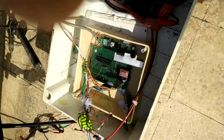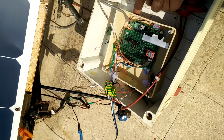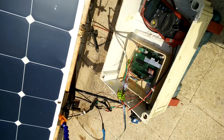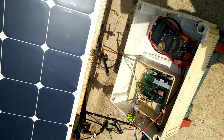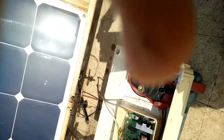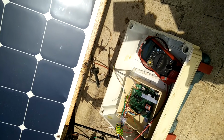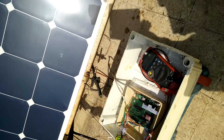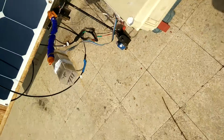Nevertheless, if water is coming down here, it will still not be inside the circuit. If it gets in, it will ruin it, because the circuit is working on very, very low electricity, and every change in conductivity will ruin the decisions of the microcontroller, not to mention that it will make it rusty and cause other problems. So this is the way I close it.